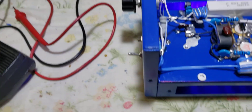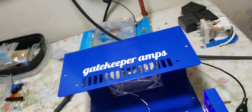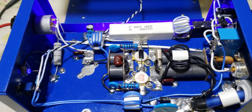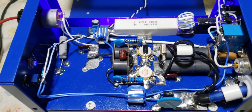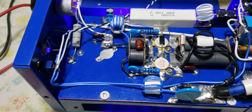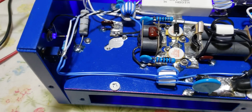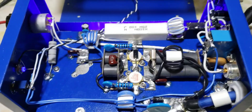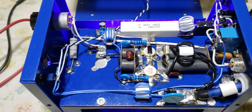The lower you go down in volts, that number will go down a little bit. But we're right there in between AB and about half of AB. An AB circuit is going to be around 0.7, 0.68, 0.7 — we're right here at about 0.39, 0.4. A little bit more forgiving, doesn't get as hot.